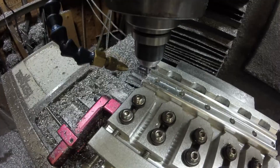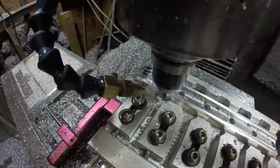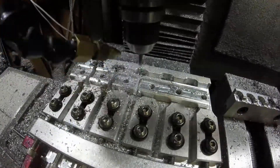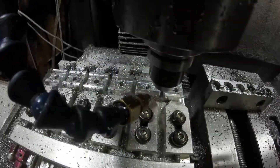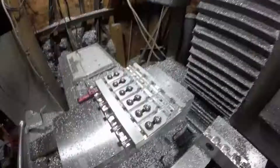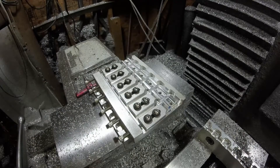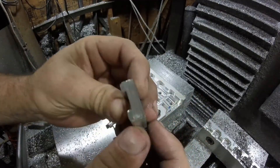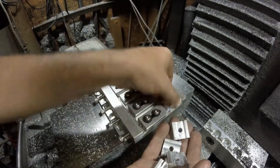I'm using a 3/16ths end mill and I'm not taking a very deep cut — I want to say it was 6 thousandths. None of the parts appeared to move; there didn't seem to be any play or anything. I imagine if you go a little crazier with the depth of cut, the speed, or a big honking end mill, you'd probably have a little trouble. But for these little parts it worked out just fine. You can see that cut edge — I don't see any chatter on it, it's a nice clean edge. So I'm thinking it'll hold pretty well, or well enough.